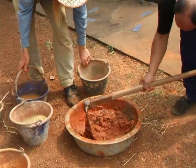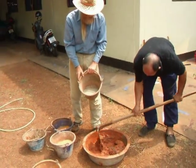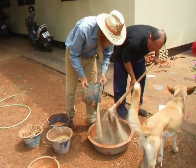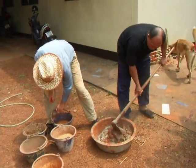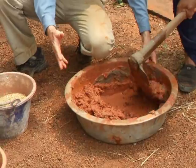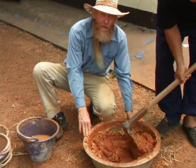Add water out little at a time so that you don't add too much. If your sand is wet, then you have to add less water. Of course you could mechanize the mixing process with a mortar mixer, but we're always trying to demonstrate the low-tech, low-cost methods. A lot of people mix the earthen plaster with their feet.